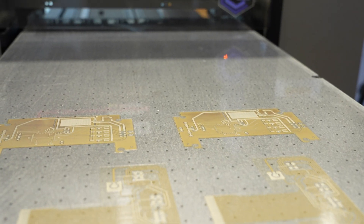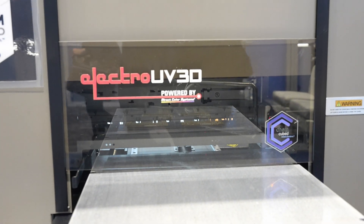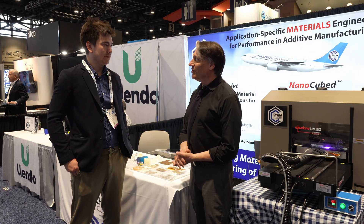It's quite flexible in many ways because of the inks themselves with the low-sintering silver ink. And because you can print a thinner layer to get the same conductivity, that also helps with the flexibility. The inks themselves have about 17% elongation.